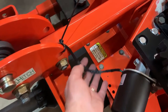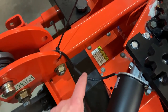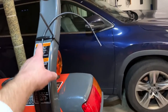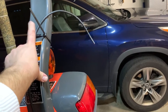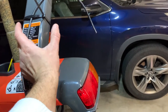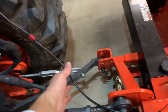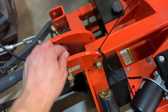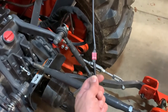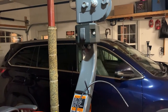I zip-tied this to create a nice drip loop so any water that collects will drip off the bottom rather than trying to enter the motor terminals or wick up inside the wire. There's my disconnect coupler, and zip ties here — these could also be bungee ball-cord hooks, which would be reusable rather than cutting a new zip tie every year. It's secured tight so it won't pull the connection at the motor. If we pull on this wire it'll disconnect right at that coupler.